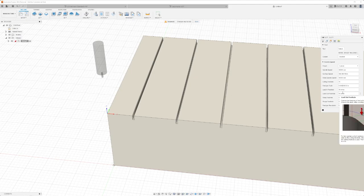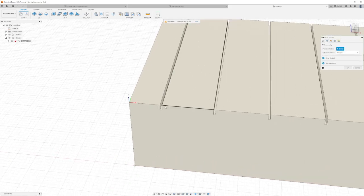We're not going to be shooting for one to two thousandths per tooth today — this bit is obviously going to be much smaller. Let's aim for around 35 inches a minute, actually let's do 25 inches a minute for the first one. We've got our tool selected and we're going to run all of these at 18,000 RPM to keep it consistent, so the only number we need to play with is the cutting feed rate. Let's set the geometry.